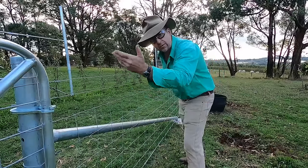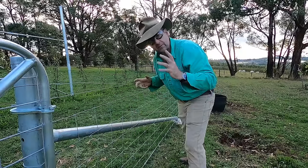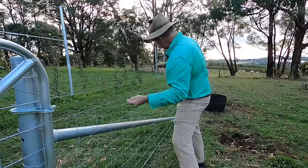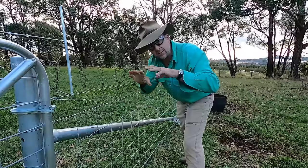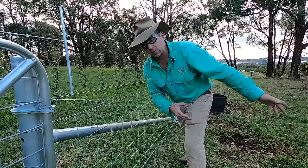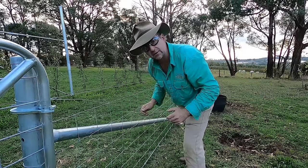Now I've run out some wire for this job and I've tied it off to both end posts using a termination knot. We're going to start from this position. Notice I've left a fair amount of slack in this wire. We want to end up with around about a foot of belly when we put the strainers on. It doesn't mean that you leave it coiled all over the ground — it basically just means you let it fall to the ground before you tie your termination knot.